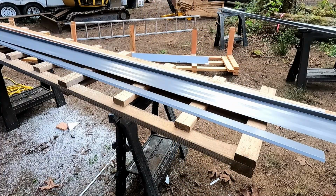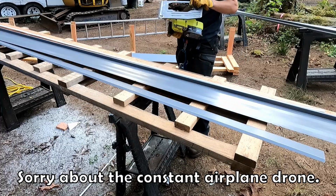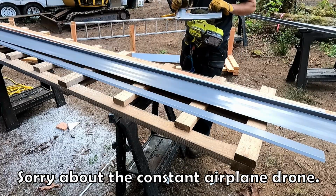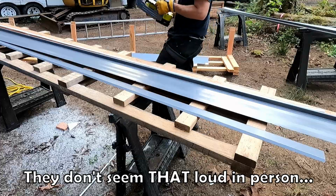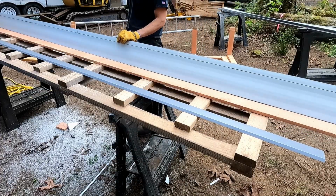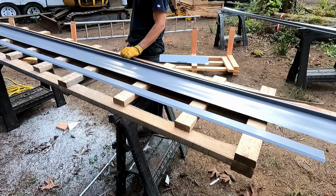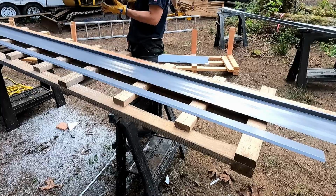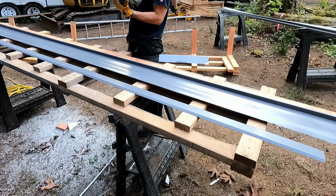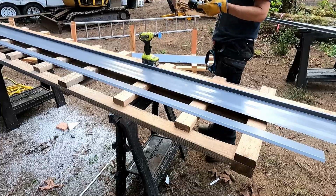So for the last portion of that cut, this was just the sheet metal blade body with no teeth on it, gumming through the softer steel of the roof, which, to be fair, did work. And gave me surprisingly good results, considering. But the idea of you keep your old blades and then use them backwards and gum through steel, pretty limited usefulness. But got the job done. I'm gonna tidy up this cut and then get to folding.